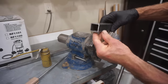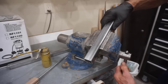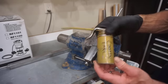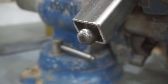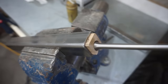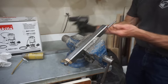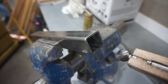To use the Seams Impossible, just clamp your piece of square tubing in a vise at a downward angle — this helps clear chips as they're cut and prevents jamming. Orient the slot with the weld and slip the extension through the tube and chuck a drill to it. I like to add a few drops of cutting oil to the burr to reduce heat and extend its useful life. Run the drill at a slow to medium speed while pulling the tool through the tube. Blow out loose chips as you go if necessary and add more oil if needed. Because the cut is made as the tool is being pulled, when the block comes out the far end, reverse the tube and reverse the cutter to finish up the last little bit of weld seam by pulling the tool through in the opposite direction.